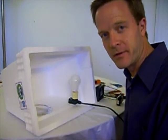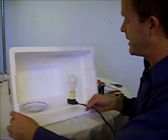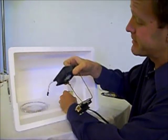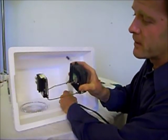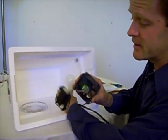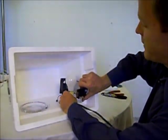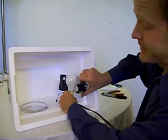I think I've got it figured out how to mount these three pieces together. The light bulb goes about here, and for the fan and thermostat combination I've bent a coat hanger into an odd configuration — it wraps around the holes in the fan and through the thermostat. It's pretty snug and not going to move around at all. That will mount to the wall, so the fan blows directly onto the light bulb and the heat goes directly into the thermostat.